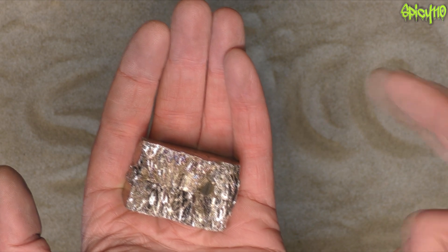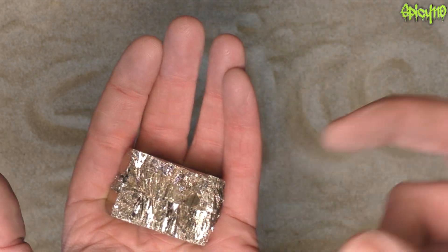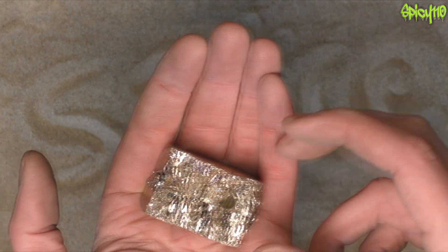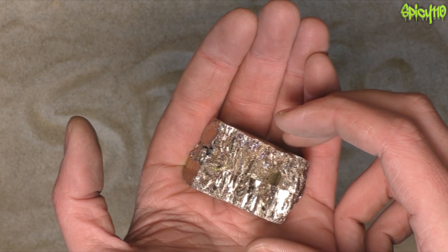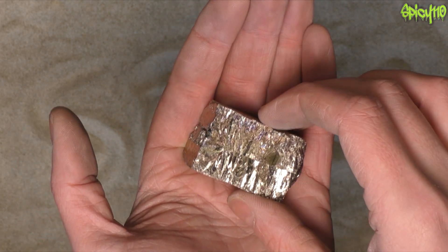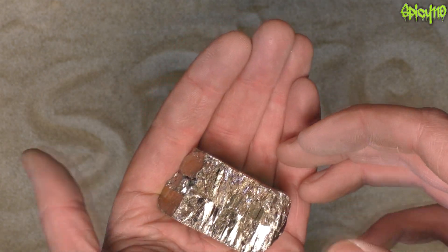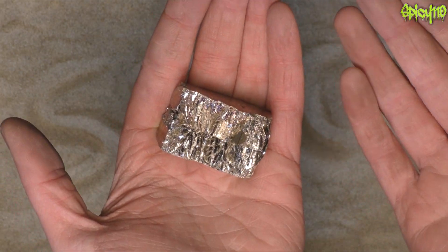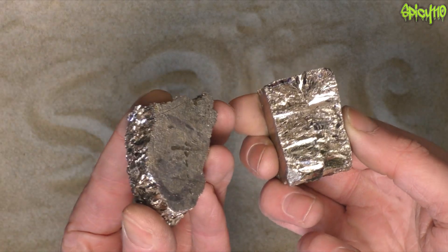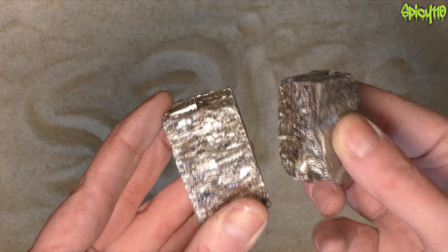It's pretty safe to work with. It melts at about 271°C — that's 520°F. Metals don't normally release gases until they're at their boiling point, and the boiling point of bismuth is 1560°C or about 2850°F, so we're not going to get it close to boiling. It's a very safe thing to experiment with, with proper precautions. The most amazing thing about it though is the crystals it forms when it re-solidifies after you melt it.